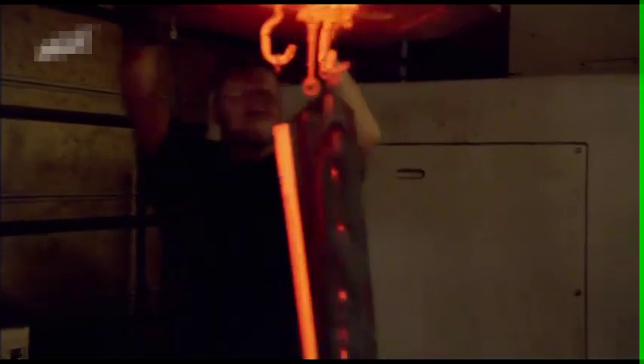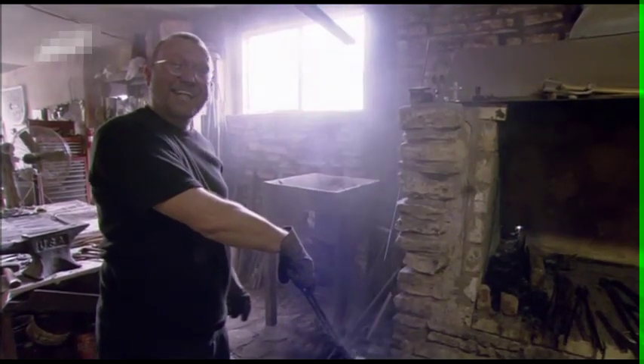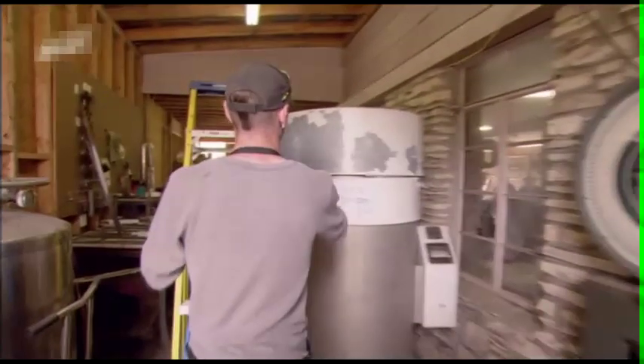But it's still not super steel. Now Dan turns to some 21st century technology to push the strength of the blade far beyond anything his ancient counterparts could have achieved. After being superheated to a thousand degrees Celsius, the blade is suddenly plunged into what's called a quench tank filled with icy cold water. That was what's called a flaming quench — this is the hardening of the blade. But icy water isn't nearly cold enough for Dan. How hot the blade gets, how quickly it's cooled and how cold it then becomes all determine how tough, flexible and sharp the swordsmith can make it.